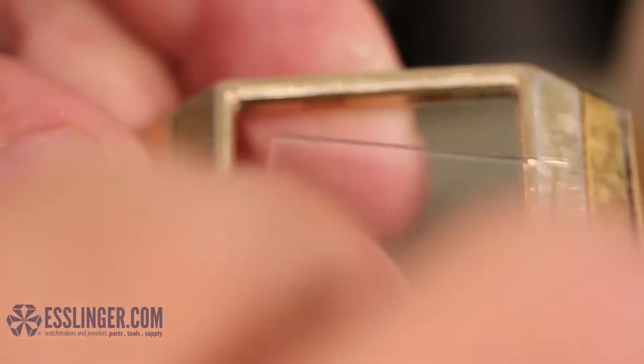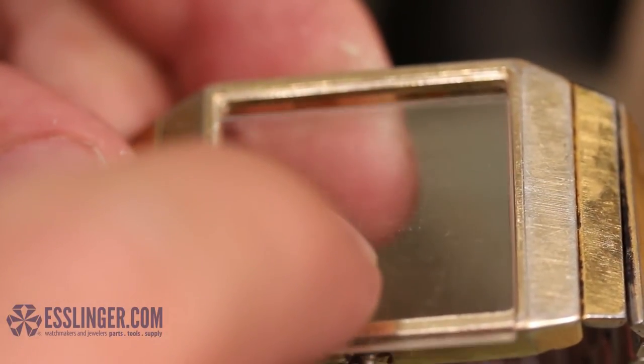Before continuing to shape the crystal, be sure to re-lubricate it to protect it. By keeping both the crystal and the grinder lubricated throughout the trimming process, you protect the crystal from chipping or breaking while you trim it.